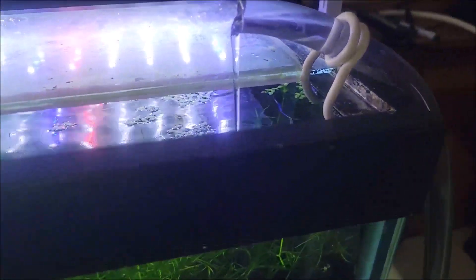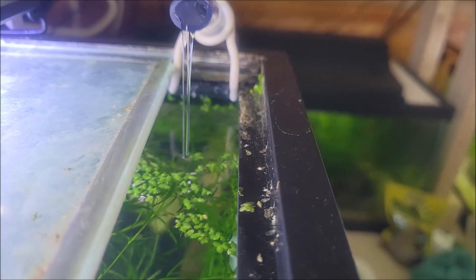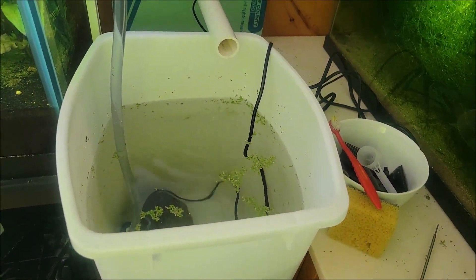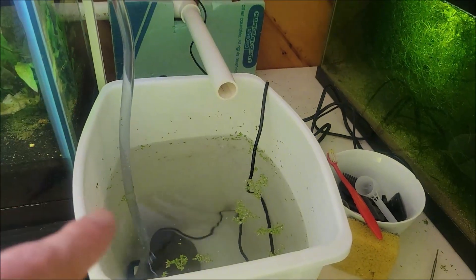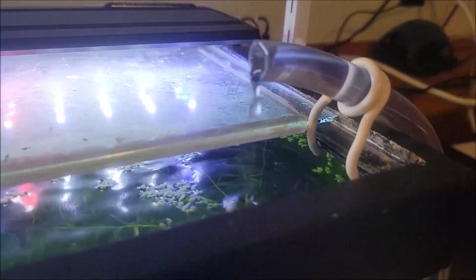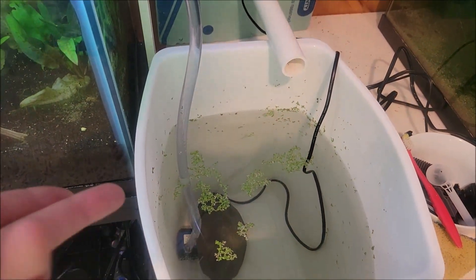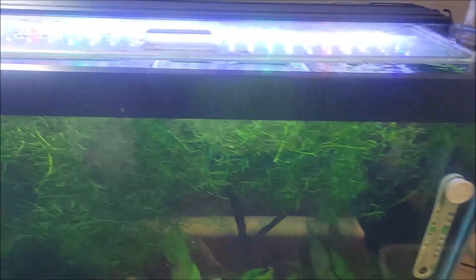All right, so this is now pretty much stopped draining. My hope is that this will eventually stop before it overflows the tank — you can see we've got a little bit of room left. This might be a boring video of me just watching this, but hopefully it's going to shut off. If it doesn't, I'll just pull a little bit of water out until it does stop, which will balance the system so if it ever stops pumping it won't have sufficient weight from this water to pump it into the tank. You can see we're almost down to a drip now, just trickling out, and I still have plenty of room before it starts to overflow. So that's going to prevent it from draining the sump into the tank and overflowing it.